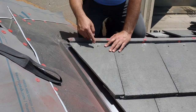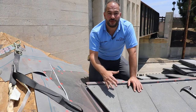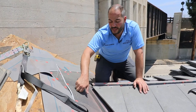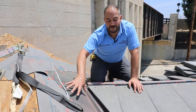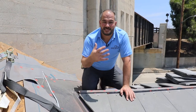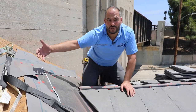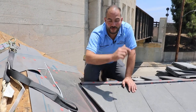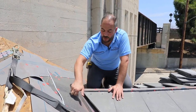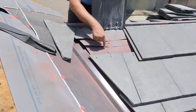The same thing is going to apply for this piece here — I would generally tie a wire, bring it back over the ridge, and nail it down. So there you have it — we're essentially done with our valley, and we'll still do the other side. Always make sure that you have a full roll of underlayment underneath your valley, and assume you're not going to have underlayment coming on top. Install your valley flashing with nails on the outer edge. I also recommend installing underlayment on top of your valley flashing, ensuring any water that comes on top of your underlayment rolls on top of your valley and off your roof, done after installing the drip edge. While installing the tiles, the last thing to remember is don't make holes in the center of your valley — if needed, use the tie wire method to secure tiles without penetrating the valley.